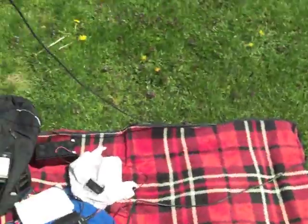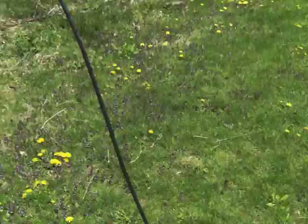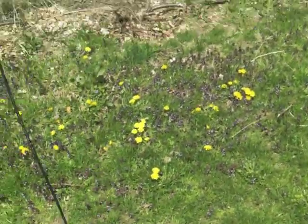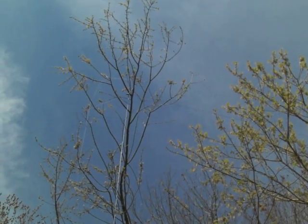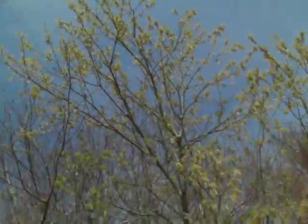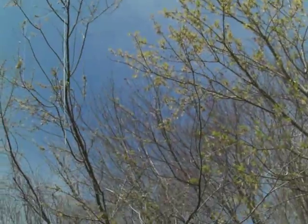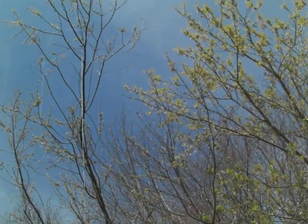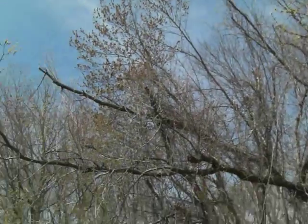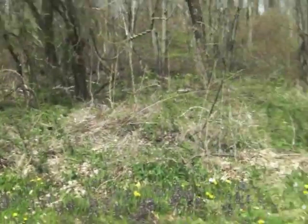The antenna is fed with about 25 feet of RG-174 — a little lossy, but not so bad. It's a 2-band resonant dipole for 20 and 40 with traps for 40 in it, and the apex is maybe 20 to 25 feet off the ground. Just threw it up in a couple of trees — nothing terribly fancy for the setup.